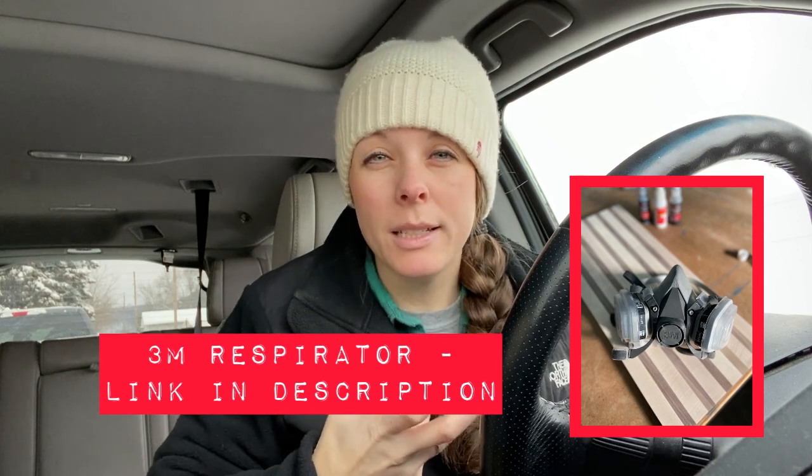There are a lot of options out there, a lot of ways you could do this. If you're going to be working with MDF, that's going to cause a huge mess — the little fibers get everywhere and it's really bad for you to breathe in. So you need to consider the area you're working in, dust collection, maybe even wearing a mask if you're not going to have great dust collection and intend to be around the machine while it's working, especially in a small enclosed area. A lot of people use dust separators — Dust Right makes one, or the Dust Deputy — two different variations where you can DIY your own dust collection with a separator so fine particles don't clog the filter on your suction.